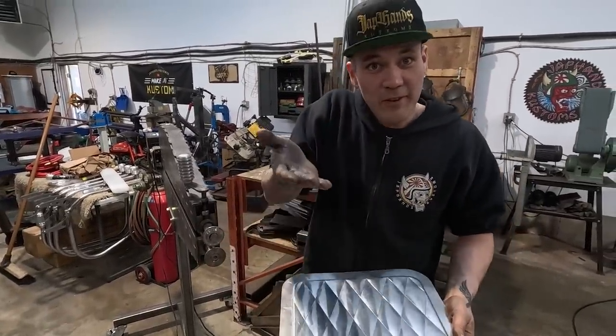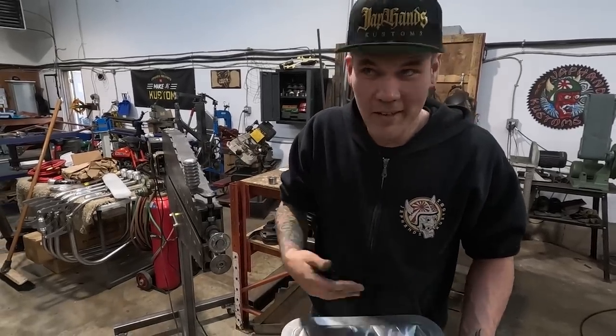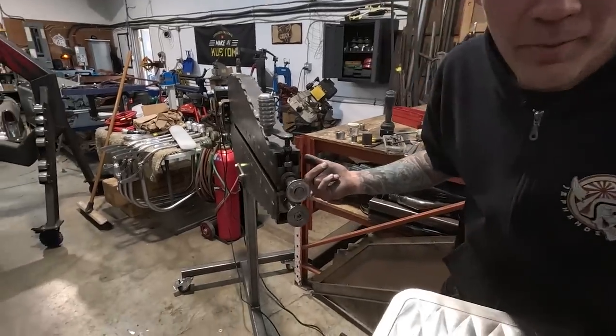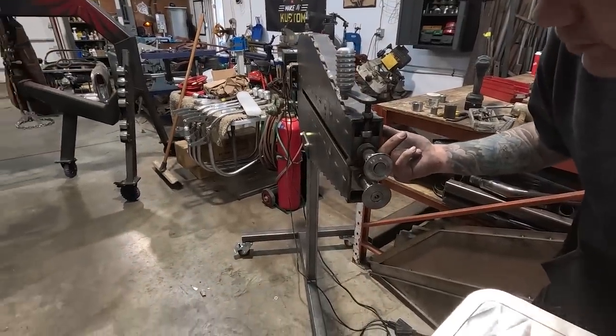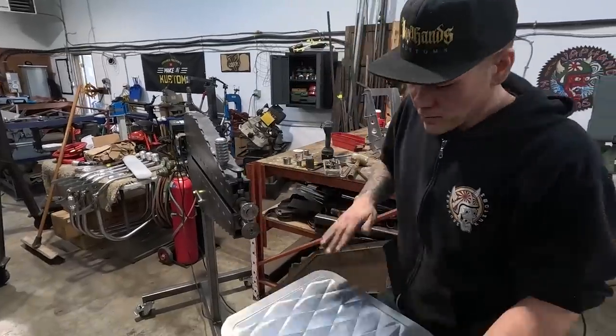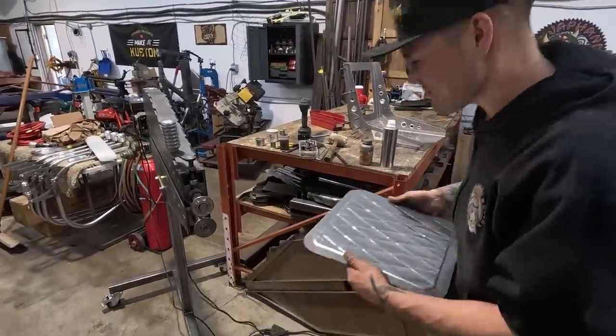Like we did the insert on the sides, like Elio suggested with the Scotch-Brite, we're gonna do the same thing here, which is perfect because I did kind of scratch it in a couple spots. Next time I'll run a little bit of tape on the bottom of this part of my bead roller. The edges are a little bit sharp. I usually do, but I just forgot. So we're gonna Scotch-Brite this a little bit and then get it Clecoed in there.